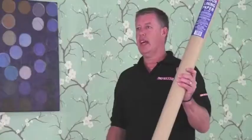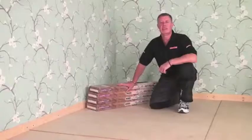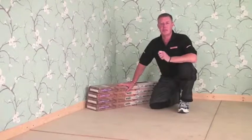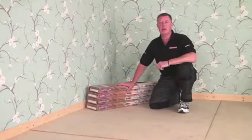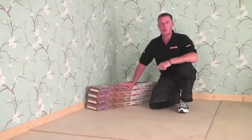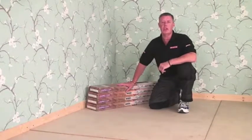If you have awkward shapes to cut around, such as a toilet or a hand basin, a lining paper and a pair of scissors are ideal for making a template. Take a minute to plan how you want the finished floor to look. Traditionally, plank floors would run away from the light or from windows. Also plan any awkward doorways or first cuts that you may encounter early on in the installation.